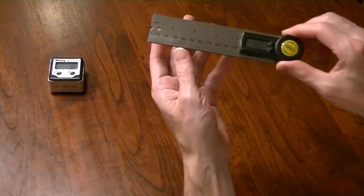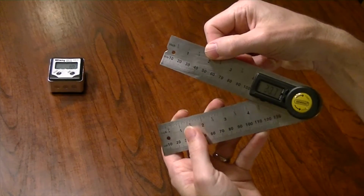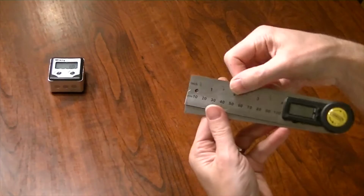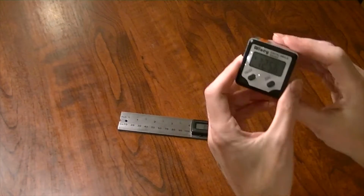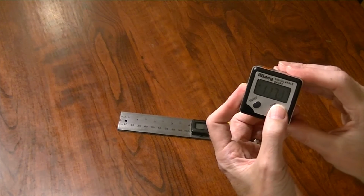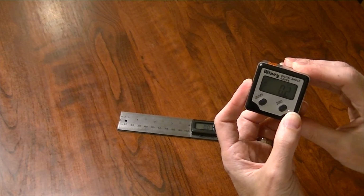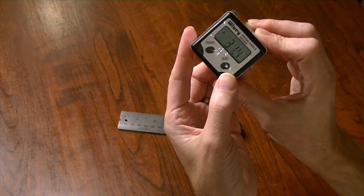Various tools are used to measure angles. This angle finder will work in any orientation so long as there is clearance for the arms. Where clearance is tight or the target angle cannot be enclosed on both sides, this gravity-sensitive angle gauge is very handy, so long as the surface being checked and a reference surface are not tilted sideways very much.